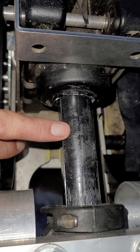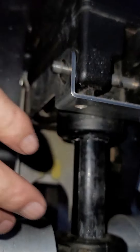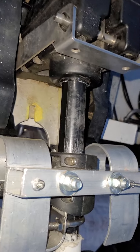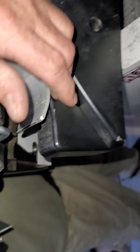I had to make a stop bracket. As you look at it right there, you can see there's a switch right here. If you don't make this bracket and stop this thing at the right place, it's going to go up against this and it's going to tear your belt up. A little hint — if you run the belt and stretch it down here on this end, just take it all loose, put it up at the upper end and put the upper end down here and you're back and running until you mess it up again. So I made these brackets here to set in the saddle where the motor used to sit. And this one on this side trips the switch under here in the saddle to stop this mechanism so it doesn't go all the way up against your motor housing.